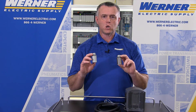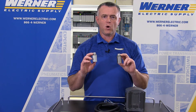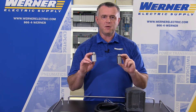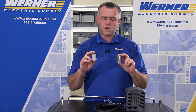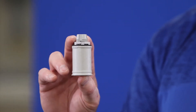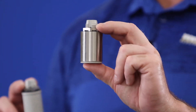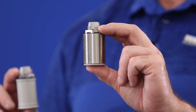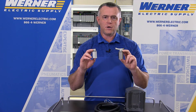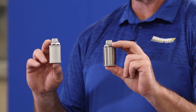You can eliminate the weep hole — which derates your enclosure to a NEMA Type 1 — by using the vent drains, which maintain a NEMA 4X IP66 rating. The vent drains come in a polycarbonate style or a polycarbonate with a 304 stainless steel sleeve. Both maintain the NEMA integrity of the enclosure to a NEMA 4X IP66 rating.